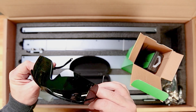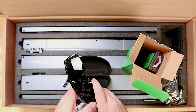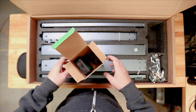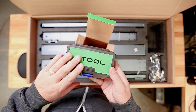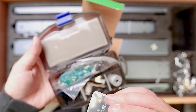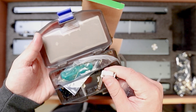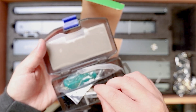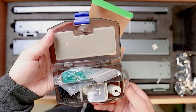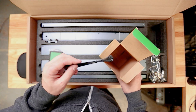It is a visible light laser, so it's pretty simple to block from your vision. Check out the OD ratings — no IR on these. They'll do the trick temporarily, but I would not rely on them long term. Also included in that box is a little xTool toolkit with a screwdriver set, a bunch of screws, a 4GB micro SD card, an air assist joint for air assist hosing, and a couple other odds and ends. Looks like it's got everything you need to at least get it put together and running. They also give you zip ties for cable management.